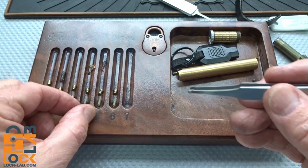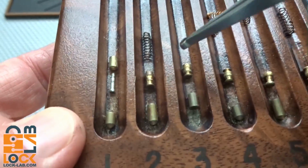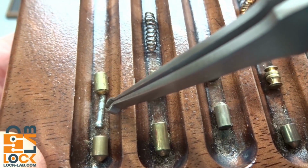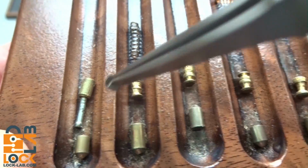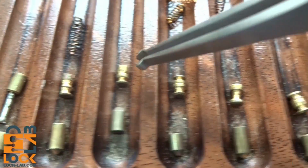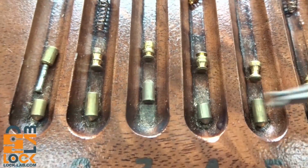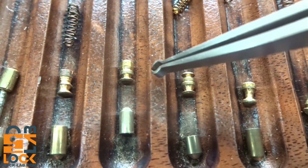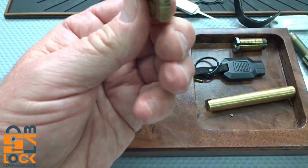That was much more difficult than what I would have thought given this pinning. This one really threw me. He was hiding up there behind the tension wrench, and he was a pin-in-pin. I thought I picked him, and in fact that tip was probably what I thought was a T-pin holding the whole game up. All the rest of these are very nicely done. Standard pins all in the bottom, and the rest of these are all handmade spool slash serrated, but they're all very sharp edges. Now in the Bible, let's take a quick look in there because we dumped out the springs.